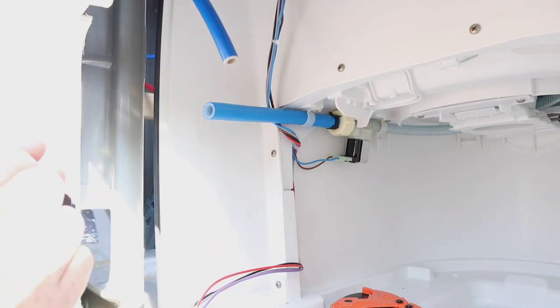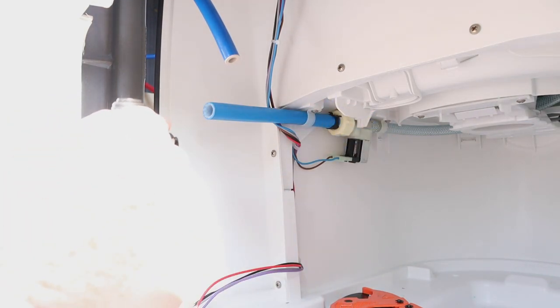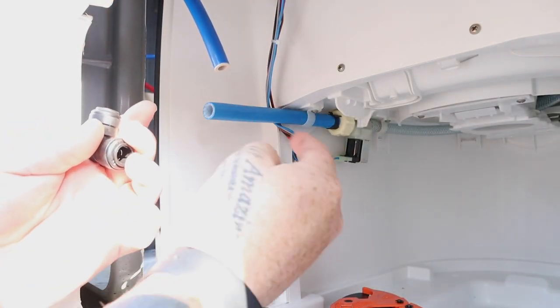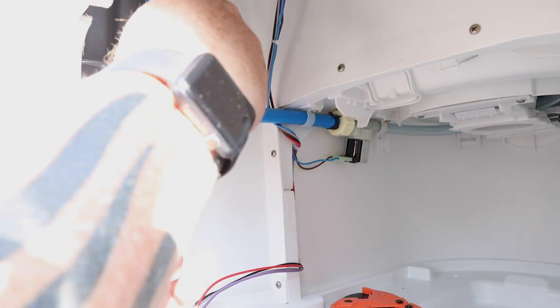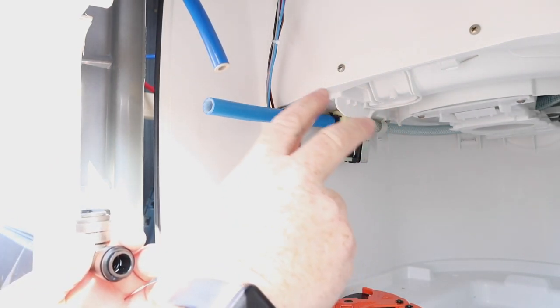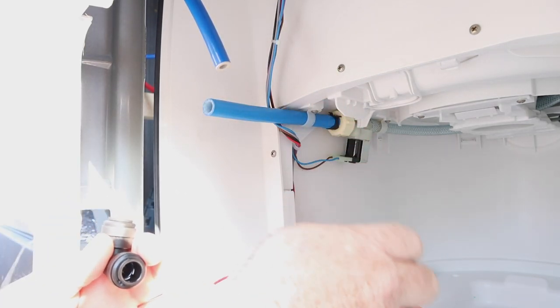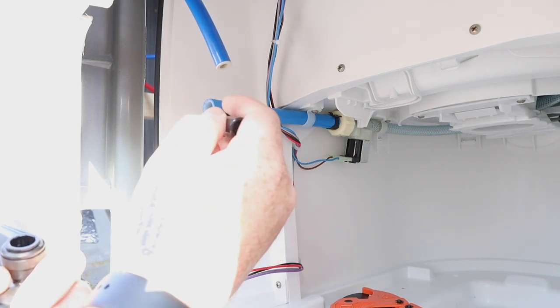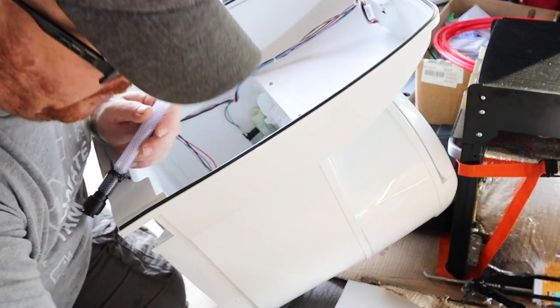The one thing I don't want is a kink, so I'm going to put an elbow on there and a small pipe just so everything meets up and lines in one go. There's going to be a couple of pipes in there but it makes sense because I don't want to be bending flex - I want it all to be straight angles and no strain on any of the connections. So first of all we're going to get this in and connect it up to a short pipe.